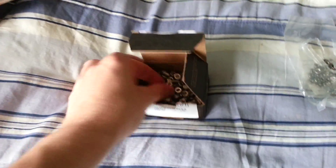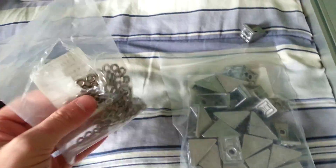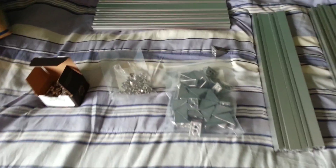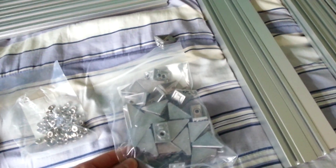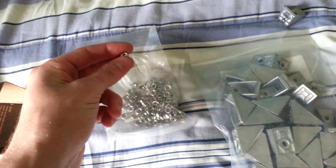I'm just going to go over everything quickly. I have M5 bolts, thin M5 nuts. I am printing out, as you can see, pillows for each nut. The pillows are really quick to print and they take up little plastic, so those will be much cheaper than buying metal pillows. All they have to do is prevent the nut from spinning when you're bolting it in, so they should do just fine.